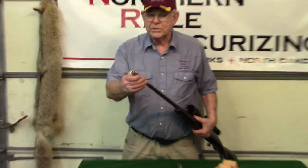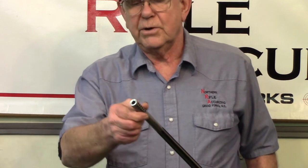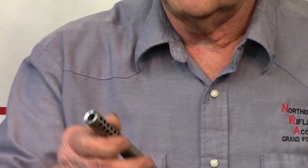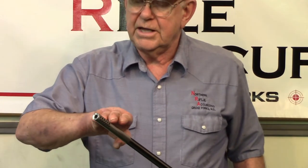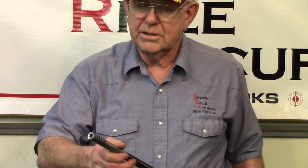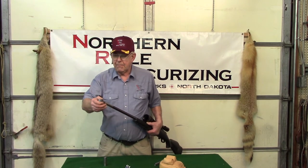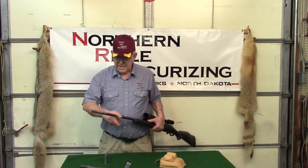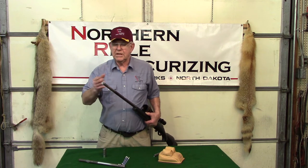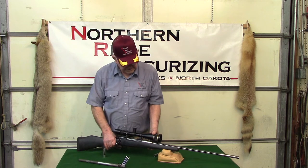What we do is we start out with a piece about an inch in diameter, then we thread the end of the barrel and machine the brake down until it matches the contour of the barrel. When we time it, it's coming out of the top of the barrel and going away from you. These are available in stainless steel or chrome moly if you've got a blued gun — we can put on a blued one and blue it to match. This one happened to be a polished barrel so we left it polished, or if your barrel is a bead blast stainless barrel, we'll bead blast it to match the contour of the rest of the barrel.